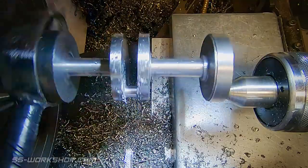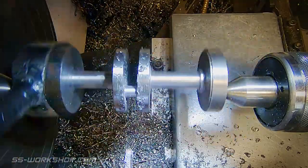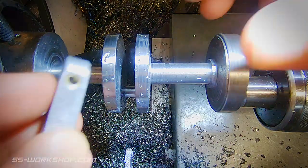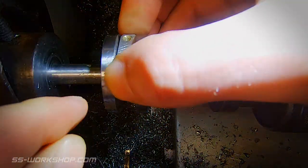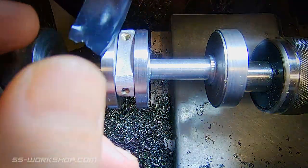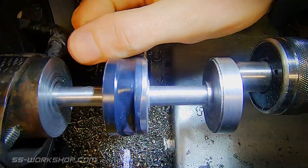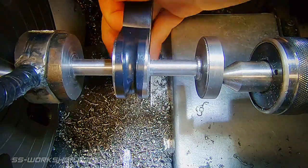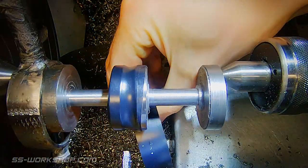This will be our final look at the eccentric crank in the lathe, as before I proceed any further an aluminium packer is inserted to prevent the part from folding up under load. This is held in place with some electrical tape. I learnt that inserting this packer was necessary from my first attempt at failure - when I placed it back between concentric centres and tightened the tailstock, the part folded.